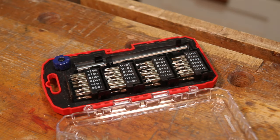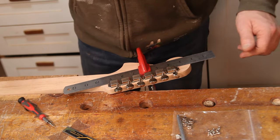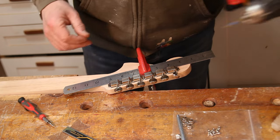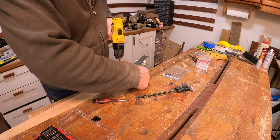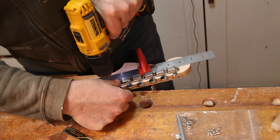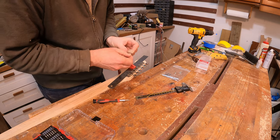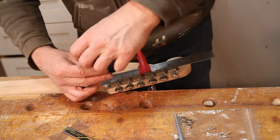All the holes are drilled ready to go for the install of these tuners. It's quite straightforward — it's just a case of drilling seven holes out and putting in seven screws and we're good to go. I've got my drill bit with a little tape flag on — you don't want to drill through. I always do these against the straight edge.